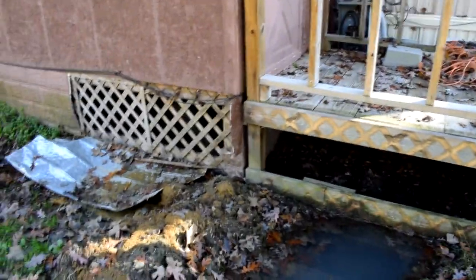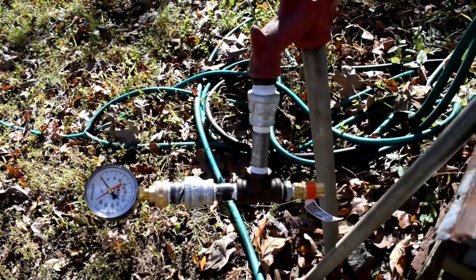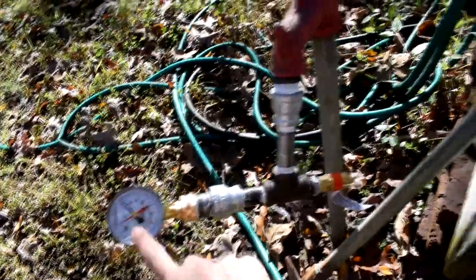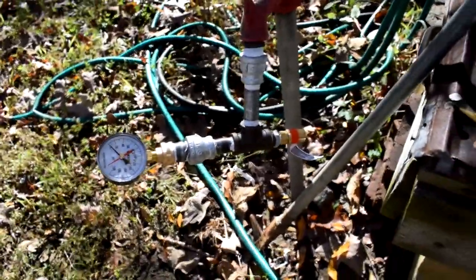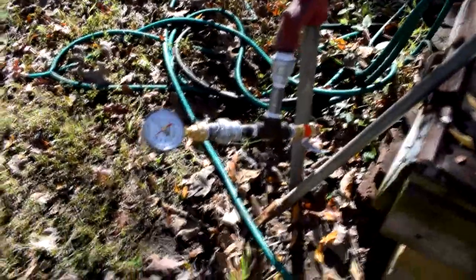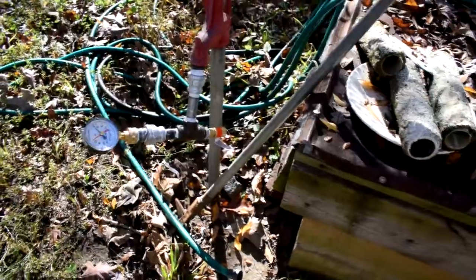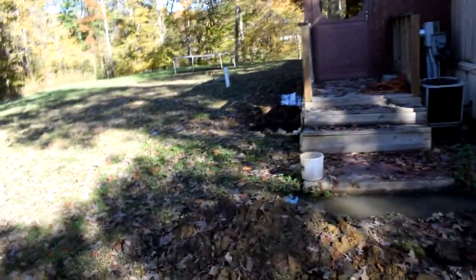My next step is: well, where is this leak at? Maybe if I can pinpoint the leak exactly. So I had a thought — I went to Home Depot and I built this little contraption you see here. We got a little meter on the side and a way to hook up our air line on the other side. What I'm going to do is cut the water off coming from the street, hook my air hose up to this air line, open that valve up, and put 60 to 80 PSI into the system. Hopefully we'll see some bubbles coming up out of this standing water out of the ground. So let's hook up the air hose and see what happens.